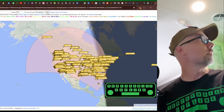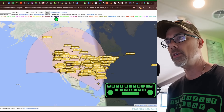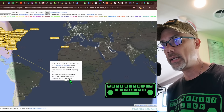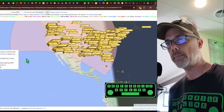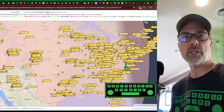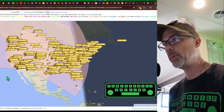I've done a couple of volleys and I'm in the middle of a contact with a VE7 station. Let's take a look at PSK Reporter — you can see I'm getting good coverage all over the US. After a couple more volleys, we're getting just off the coast of Africa: ZD, St. Helena, and Canary Islands. My friend is over in Hawaii of course, and good coverage all over the United States. Plus one, plus five, plus four, plus six. Some of this has to do with the receiving side, some with the transmitting side, but you get a good idea that we're making contacts out there. Our signal is being heard and our pink blob is looking pretty good.